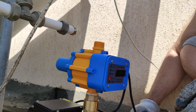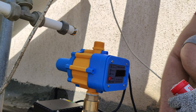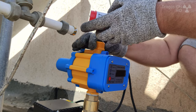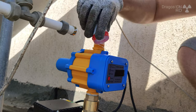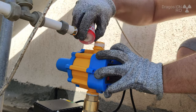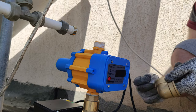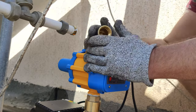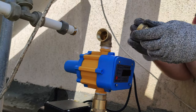First part is a 90 degree angle fitting. I apply sealant on it - this is teflon mixed with a bit of sealant paste. It's like a wire and you just put it around the threads. This is important - always clockwise as you look at the fitting, the screw. Clockwise because when you screw in the fitting, you want it to go in the same direction as the tape, so it doesn't fray.